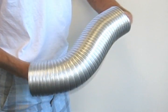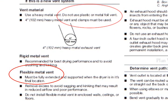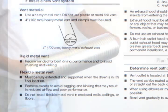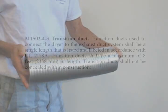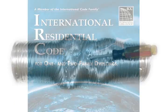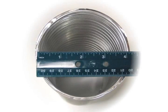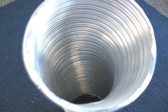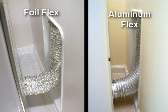The aluminum flex, or semi-rigid flex, which is often specified in the dryer manufacturer's installation manual due to its fire retardant capabilities, is much more difficult to work with, exhibits very poor stretch to compression ratio, and just meets the testing standards set forth in the International Building Code dealing with its puncture and deforming characteristics. The value in this flex is that the inside dimension of 4 inches is never compromised and the smooth interior surface provides little friction and therefore a smart efficiency choice. So we have two popular options, but each exhibits unique disadvantages.